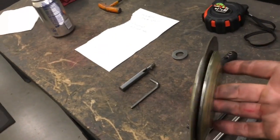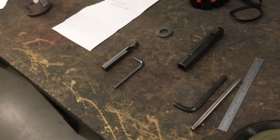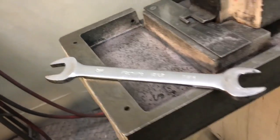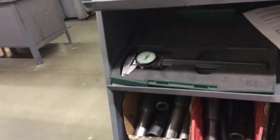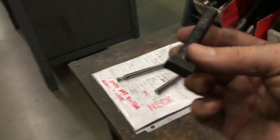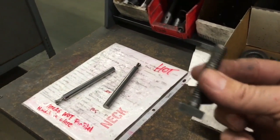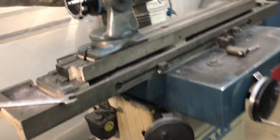Other things you need for these machines: a three-quarter and 11/16 open-end wrench, because you've got T-bolts going through — kind of like a mill — but these are much smaller, 3/8-16 thread.